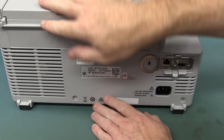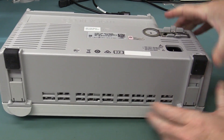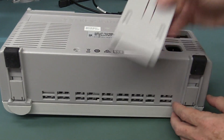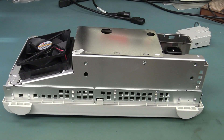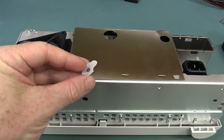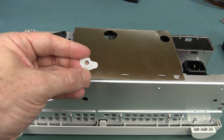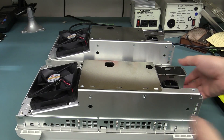We've just got four screws on the back here, including a secret squirrel one inside the probe compartment. We need to release the module. That should be enough to - ta-da - pop the hood. And we should see exactly the same awesome build quality that we saw in the original 3000 series, and it's all shielded of course, very nice. Is that part of the plastic case broken off on the inside around that screw hole? Someone tightened that screw up too tight and fractured the plastic.